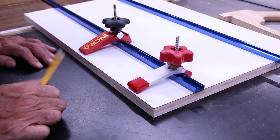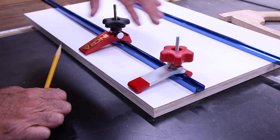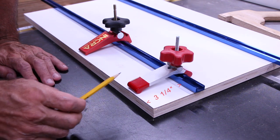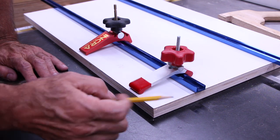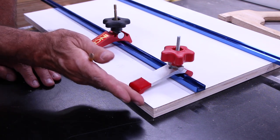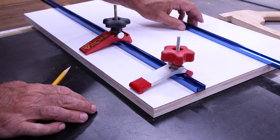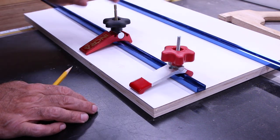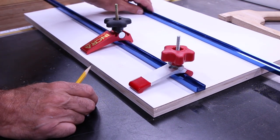Now it's time to run the dados for the t-tracks. For mine, I'm gonna put the first one three and a quarter inches away from the edge, because my hold-downs are three inches which will line them right up to the edge. Remember, we're gonna be cutting off just about an eighth of an inch off this edge so the blade is right up against there — like a half zero clearance. My middle track I'm gonna put between there and the edge, split the difference. You can customize yours — if your hold-downs are longer move it over, shorter move it in. Just customize it to your shop.